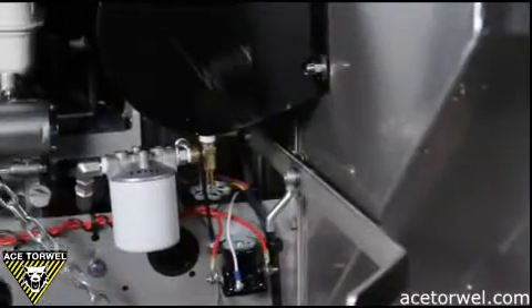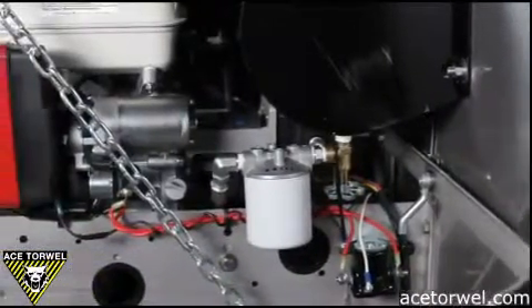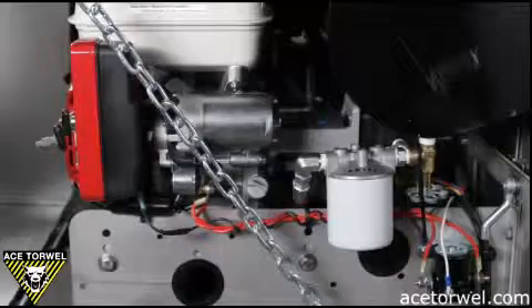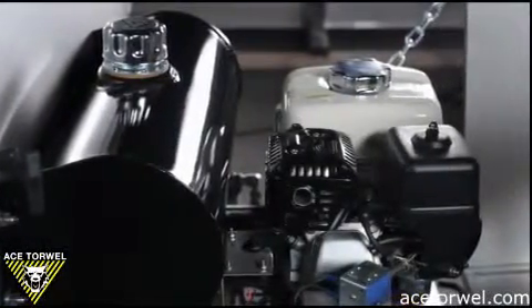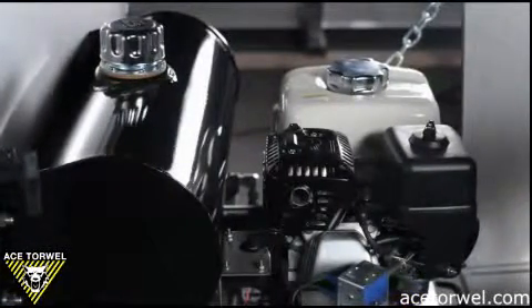It is a pump driven hydraulic system that delivers to two hydraulic motors — one for the spinner and one for the conveyor. There is a feature that throttles the engine up and down, which will give you more volume or less volume as you speed the motor up or slow it down. Proven for 1.3 yards up to 3.9 yards in capacity.